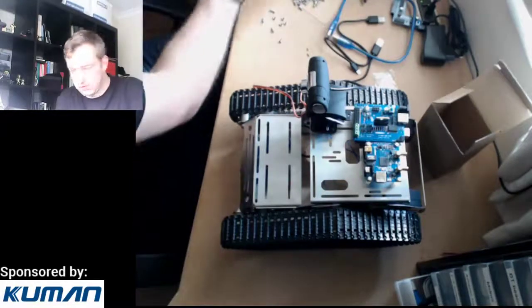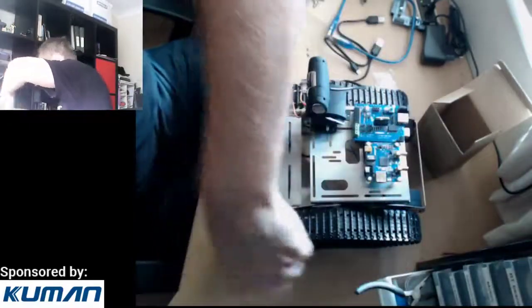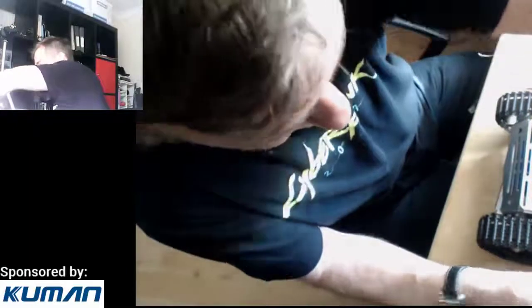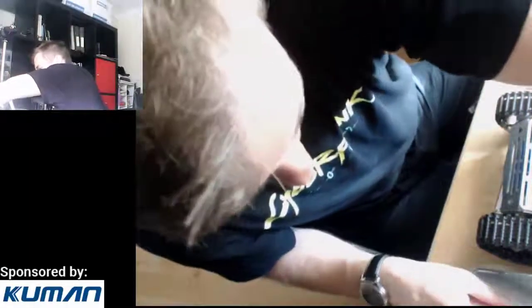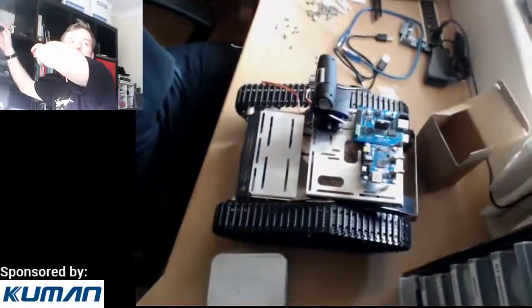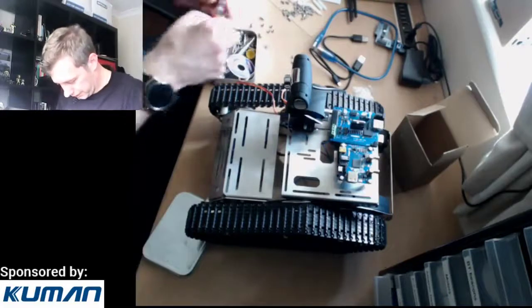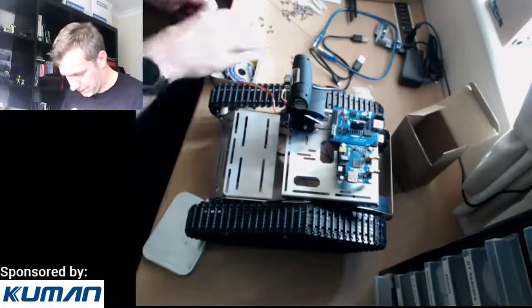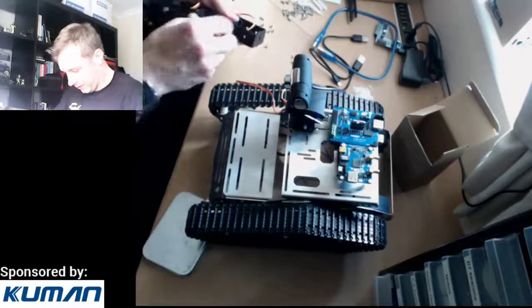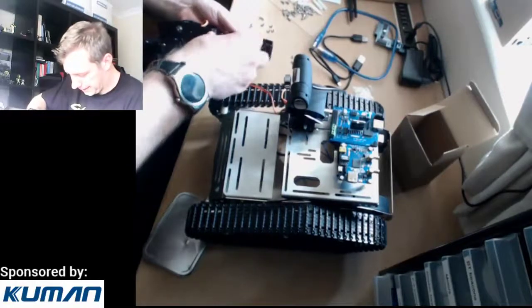And we need a bigger end for this one. Just try to get a second screwdriver, maybe. Definitely put the camera a little bit too close to my shelf with tools. Gonna move it back in a second, just don't worry guys. Can you see it? Not yet. Now you can see it. Okay, because this screwdriver, it's good to have 2 screwdrivers, and this one has a bigger end. It's going to be easier. You don't have to swap them constantly. So, I'm just going to unscrew this one and release the servo, and we're going to quickly mount the plate and then put the servo back where it was.